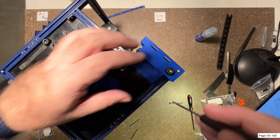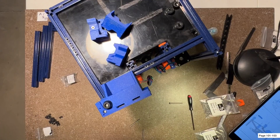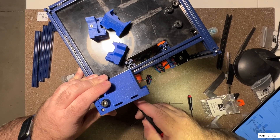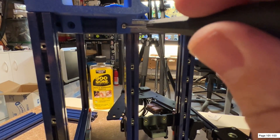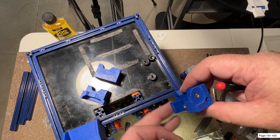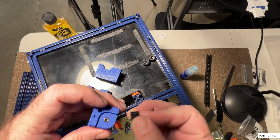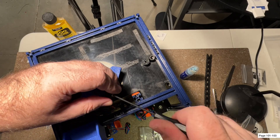To install the feet you're going to need some M3x40 screws - you need four of those - and you should just be able to drop that down and it's going to go right into the extrusion. After you do that first one, you should have some M3 preloaded nuts here, and you're going to want to scoot those over so you can line them up and install them. You're going to use M3x10s to secure those. Here's another angle - you can see the M3x10 goes in right here. Here it is all installed. Next I'm going to do this one. With the M3x40 screw you've also got the Bowden hole, so your Bowden tube can go up through here and feed your toolhead.